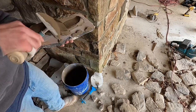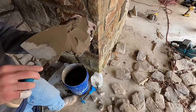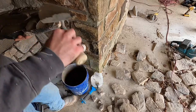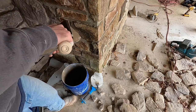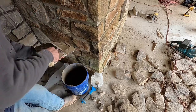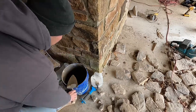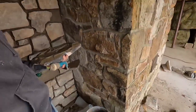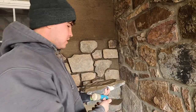Get a scoop of mud. Something important: you don't want to get too thick with this — if you get too thick it'll just slip off the wall. I go about a quarter to a half inch thick, spread it all over nice and even. Clean your trowel off.